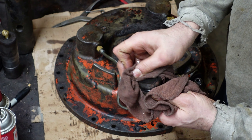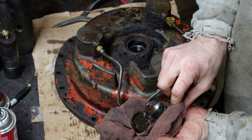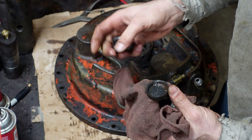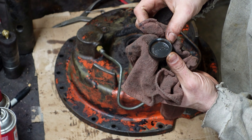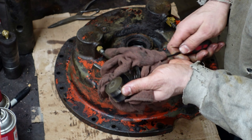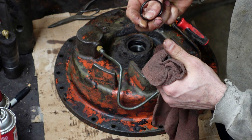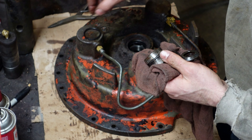Looks like there's just a piston with a dome top, and behind it a little rubber cup seal. It says 1 and 5 eighths — that's probably really standard — and there's a part number on there: XB74190 USA 1 and 5 eighths. This goes in and this has a seal which looks like probably an O-ring. I'll pop it out and see what we got. It's sort of a square profile — I'm not sure if that was round or if it was always kind of squarish, but I'm pretty sure an O-ring will work.